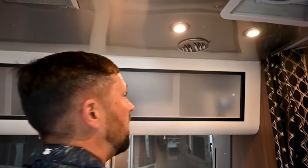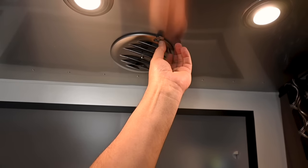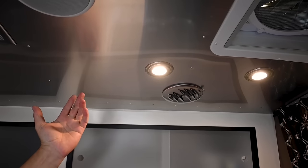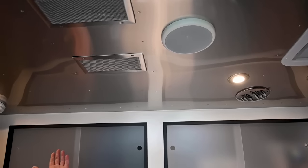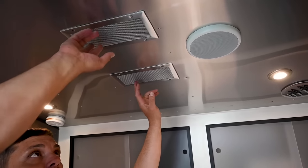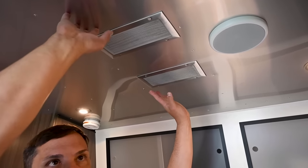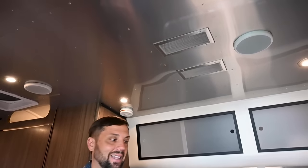The ducted air conditioning I mentioned earlier — here's the ductwork. There are four ducts just in this main area. You can spin them to change direction, shut some off, and direct more air conditioning to other parts of the trailer. This greatly reduces the noise level. There are also intake filters here that you need to clean periodically — don't let them clog, as it will make the AC work hard and shorten its life.